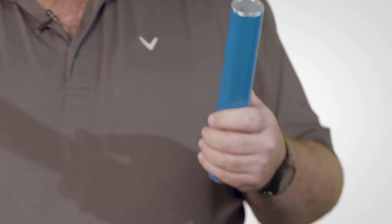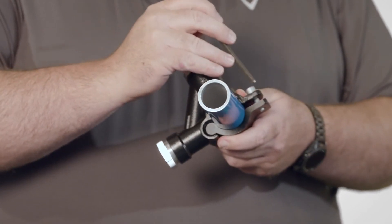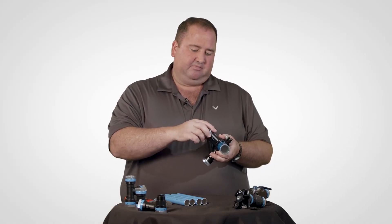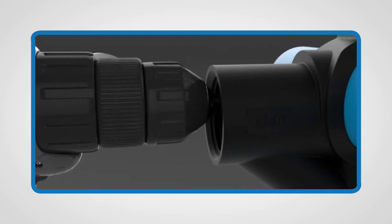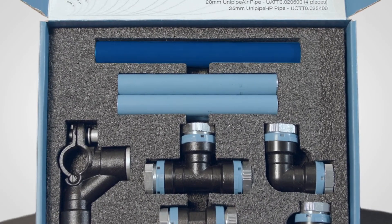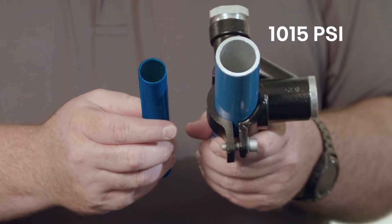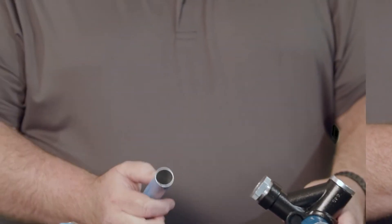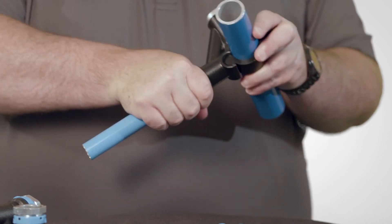Now let's put some pipe together. Take the dark blue 25mm UniPipe HP sample and slide the saddle branch onto it — place it anywhere you would like. Tighten the bolt into place, then remove the access plug and imagine you are drilling into the side of the pipe through the branch. Replace the access plug and tighten it with your Allen wrench. Note that the high pressure pipe is included for comparison purposes only — you would never mix the two in a real piping system. Insert the air pipe into the branch squarely and completely, then tighten the nut to hold it securely in place.